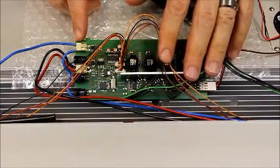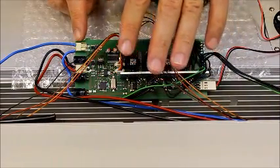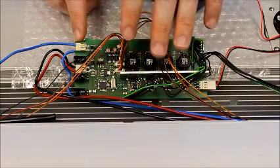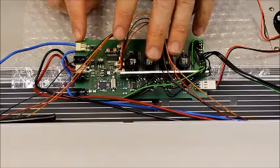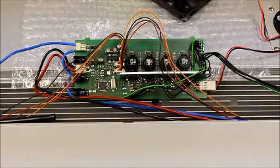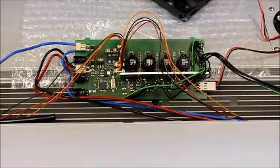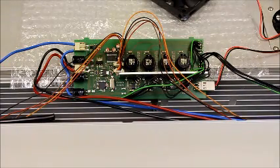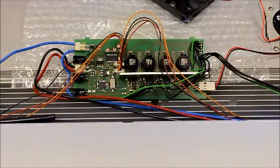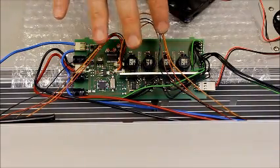Now that we've got all the wires in place in our new KSQ, we want to double-check and test the fixture quickly to make sure the LEDs for this spot and the spots after it are now working. I've propped the fixture up off the table so we don't burn it when the LEDs come on, and I'm going to plug it into the control box and test it. Looks good — the LEDs are now firing for this fixture in all three spots, so we're good to go. I'll go ahead and unplug the fixture and then run the wires back in for the KSQ.